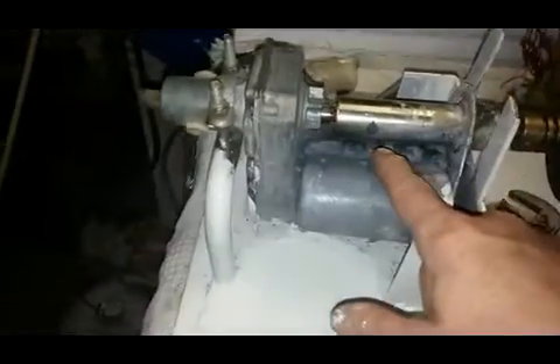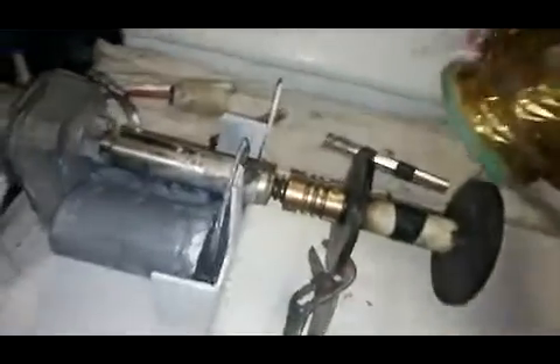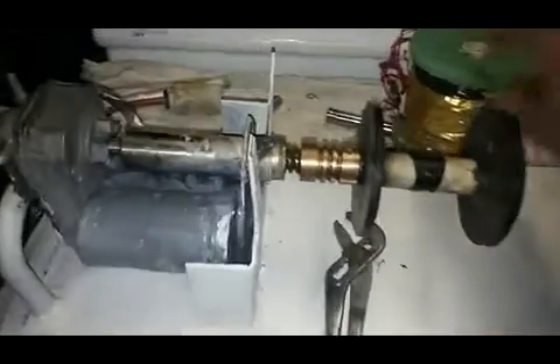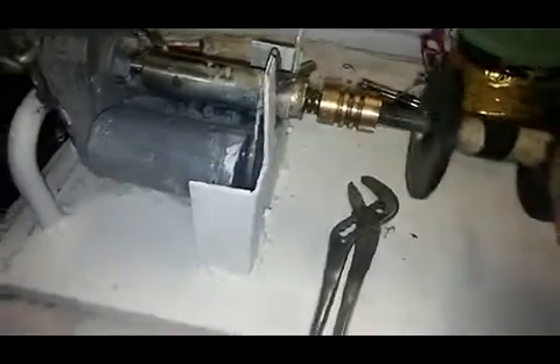It's gear driven and it's powerful. I can wind this big one with it. I could use this twisted-type wire. Usually people have to use a lathe to wind something like this, and this will handle it — it's got some power to it. Like I said, it goes on a chair. So I welded this all up and put a little whitewash on it, and this is where I'm at. I'm trying to build my first decent, half-decent winder that has some power, that you can slow down, and have some precision winding going on.